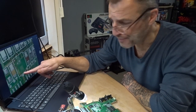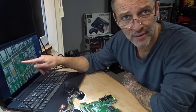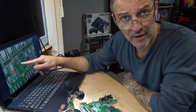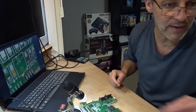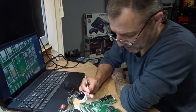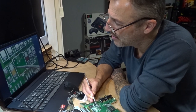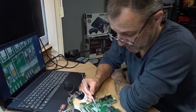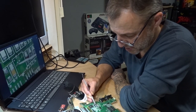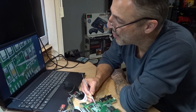So what we're going to have to do here, the corrosion from the capacitors has obviously just started. We've lost a pad. Me desoldering it, it's pulled the other pad off. So we scraped this away. I don't know how much of this is still attached. Let's just check. Oh, it's barely attached over there to that capacitor there. So you can air flat it down a bit. There's a bend on that.